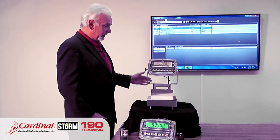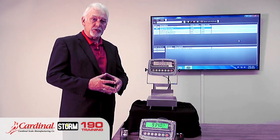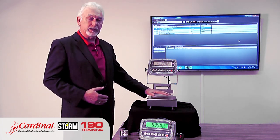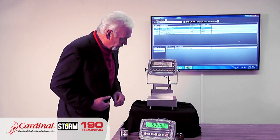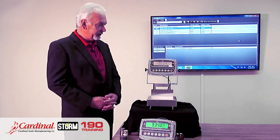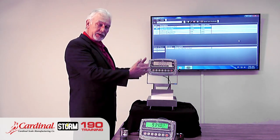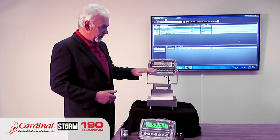What's important about this heavy base and the 190 is the stability of the platform. In many poultry and beef applications, they're actually trimming meats on the Admiral scale, utilizing the 190 to hit the target weight. The heavy stainless gauge allows that stability to work fast and get accurate weights. The capacitive touch keys use body impedance, so just touching the keyboard is all it takes — no tactile keypads to destroy. If an operator has scissors or a knife on the production line, they can't destroy the indicator.